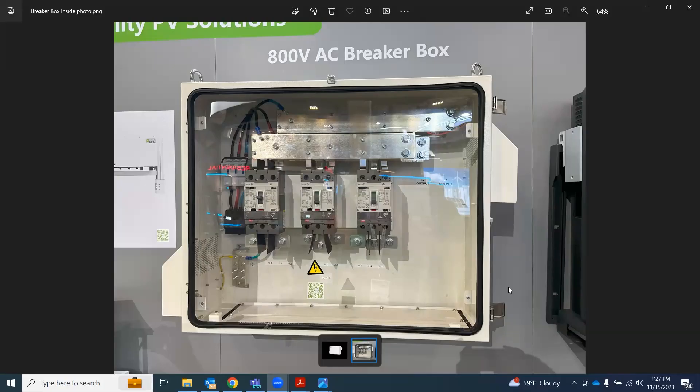This is for your less than five megawatt solutions. It does the same function — it is a three-in-one combiner, the same function as the switch box. It includes three 250-amp molded case circuit breakers with a 50,000-amp interrupt capacity, and this meets the requirement for individual circuit protection for each inverter circuit. At the bottom of this enclosure, where you're seeing the molded case circuit breakers, that's where the output of the inverters would attach. The combined bus bars would be the output up to the step-up transformer — the pad-mounted transformer in this case.